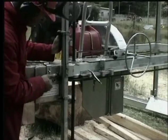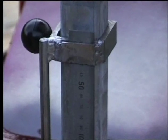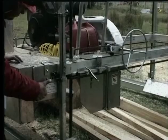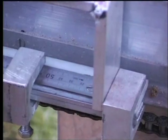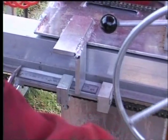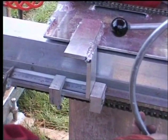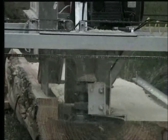The depth is set on the ruler which has a micro switch that stops in the right place each time. This model cuts up to 300 millimetres deep. The width is adjusted by hand with a ruler that has an adjustable stopper for quick, accurate adjustments, and cuts a width up to 150 millimetres. The mill cuts with an accuracy of plus or minus one millimetre.